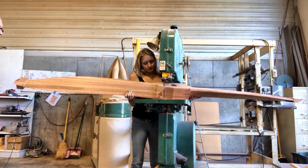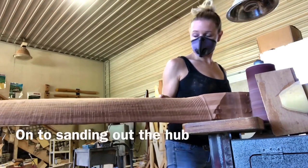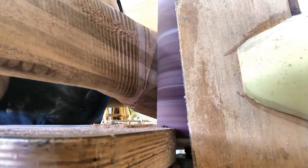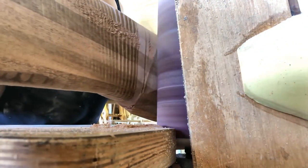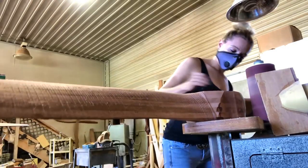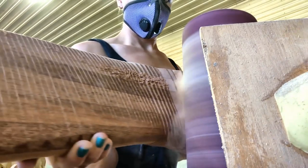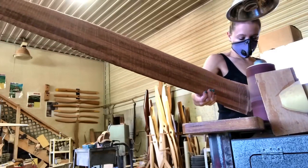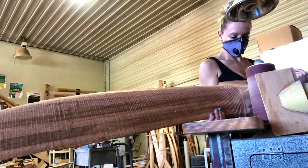The next day I take them out and put them in our tracing lathe, so I'll do a rough cut of each blade. You can see it leaves a little series of grooves down the prop. I set the pitch and then do a final cut of each blade — that puts it very, very close to exactly how it needs to be. From that point I'll cut all the chunky material off with the bandsaw; the ends get cut close to the diameter.